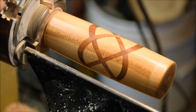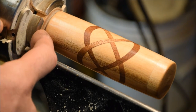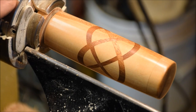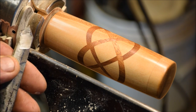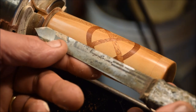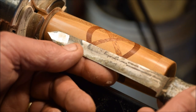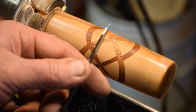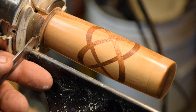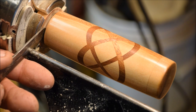I'm just about to part this piece off and it's coming out real nice. I've got the parting almost completely done. Before I did, I used a little bit of sandpaper and sanded it back in here very carefully, because it's a tight little recess right up next to the jaws of my chuck. I'm using an extremely thin parting tool which I made out of a forged steel old kitchen knife from the 1940s that I inherited at a garage sale. It's made from carbon steel, so it keeps a really nice sharp edge — very, very narrow, under a sixteenth of an inch at its widest point. Always remember, when you're parting something off, give yourself at least one and a half blade widths so you have wiggle room and your tool doesn't bind.